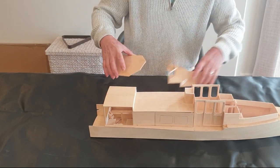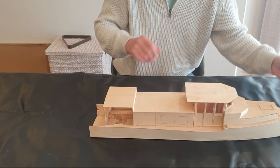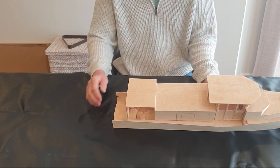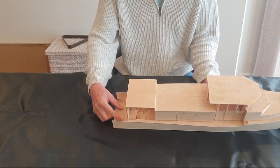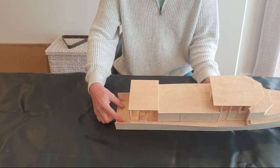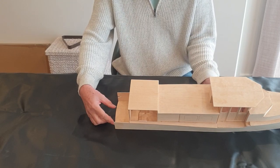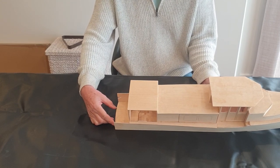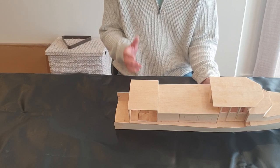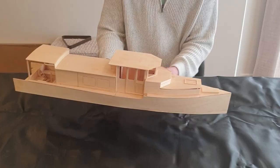I can hear you asking what I'm going to power it with — well, that's an interesting question. After much deliberation I decided to power it with twin 60 horsepower four-stroke outboards, hidden under the aft deck. This is great for noise reduction; from about the saloon forward you will not hear engine noise while running. One of the reasons for having outboards is because we'll be in a lot of shallow water — we can kick those engines up a little to get through very shallow areas, and if we get weed on the props we can tilt the engines up and access the props from the swim platform.